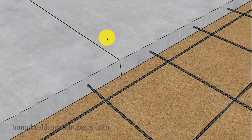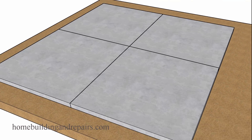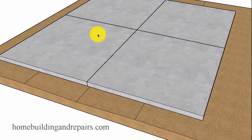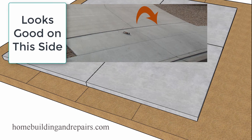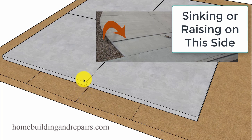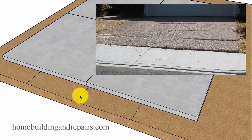By the time you're done watching the video, hopefully you have a better idea about how the rebar, when it's set up like this, can connect the entire driveway together and seems to be the best way to build something like this. Here we have the slabs in there, and we have a 20-foot by 20-foot driveway without any soil erosion. But now we have some soil erosion, so we could have some problems. This is usually what creates most of the problems for a driveway — soil washing out from underneath, soil settling because it wasn't compacted, some type of soil movement that's raising the concrete up and then lowering it down through drying out and getting wet.